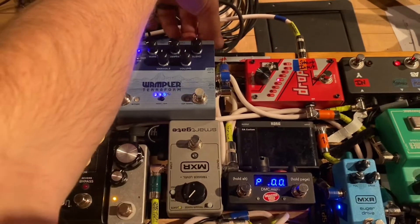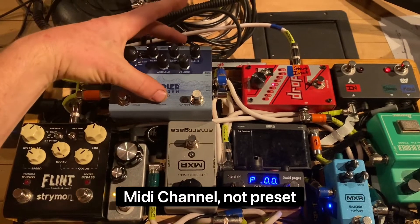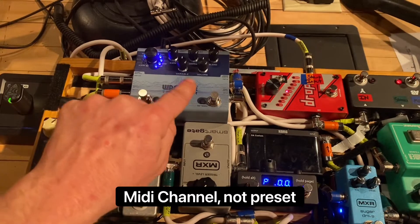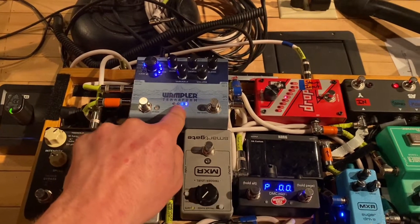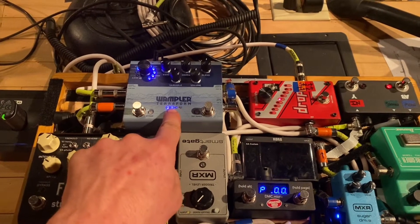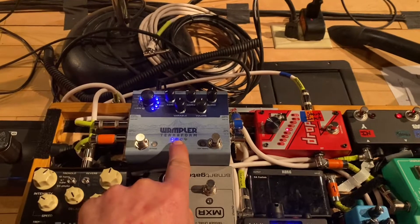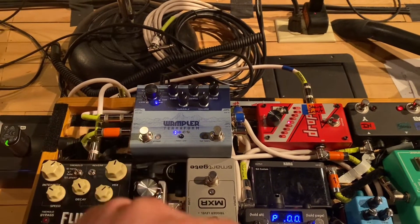What we're going to do first, just to confirm that the Wampler is in the correct preset channel — go ahead and hold down your preset button, give it power again, and you'll see it starts flashing. That strobing, cycling four-light LED right there means it's in Omni mode. You can go through your settings and set it to whatever channel you want using the binary code — it's in the Wampler manual showing you what all of them are. But we're going to keep it in Omni. Now we're going to hold down. You'll notice it'll eventually go back to the effects menu.